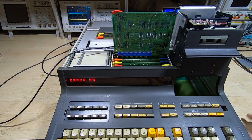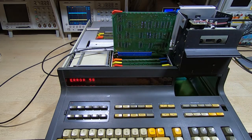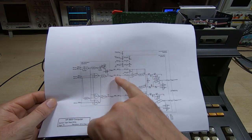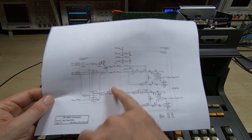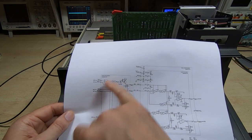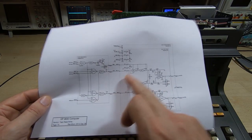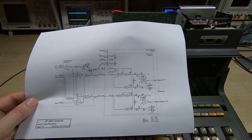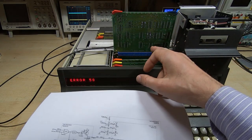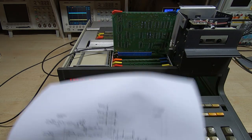I want to show the full fault-finding process — if you'd like to see more of this, leave a comment. We'll start at the beginning of the sequence. It stores information on two channels with simple pulses, so we'll start by examining the two data channels. The WDA and WDB signals each have a test point on assembly 63. We can look at those test points to see if we're getting data — if we are, we'll follow it through. I'll get board 63 onto a riser and see what we can find.